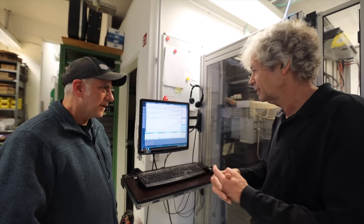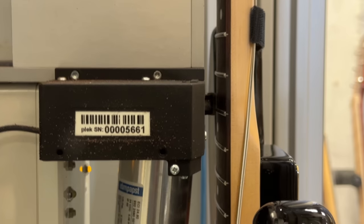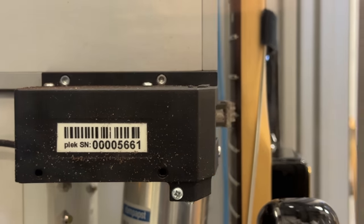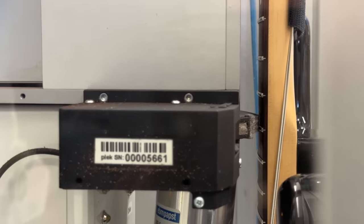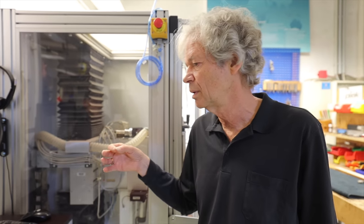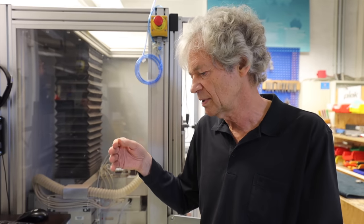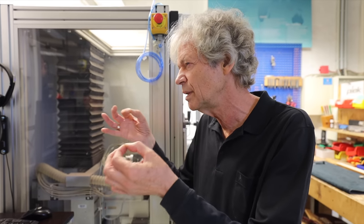When you have set the virtual fret dress, this machine is able to dress the frets. The tool runs in front of the frets and puts a tiny little bit of oil on them to make a nice, smooth cut. The Plek also works on improving its own processes by conducting an additional calibration scan — it records how accurately it made the amendments it set out to do. We scan again after dressing, which is important for calibration: the machine notices how much it was supposed to take off versus how much it did, and from there does little corrections of thousandths of millimetres. It's just incredibly clever engineering.